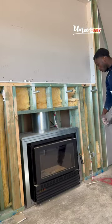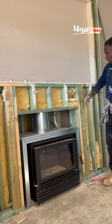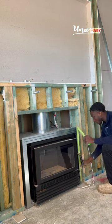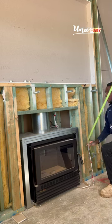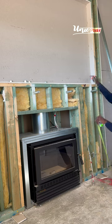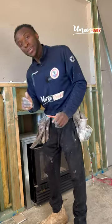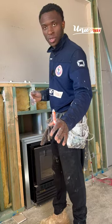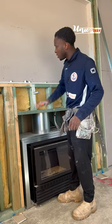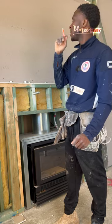I've got blocks on the ground so I can come off the block to get the rest of my measurements. This is the other center of that, and the height — you gotta have something on the ground. That measurement is 590. For this board right here it should be the same, but I'll double check — I got 1190. That's not good. I have a little situation here that we have to fix. The height of my plasterboard is 1200 high, and the height from the ground to where this lands is a little bit over 1200. If I had a join there it'd be a problem.